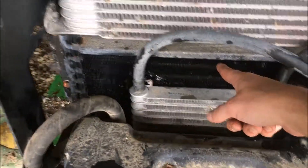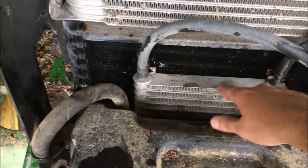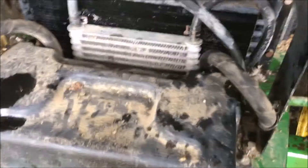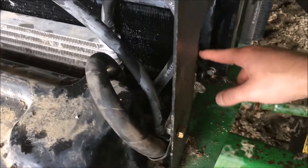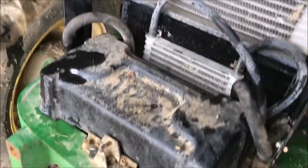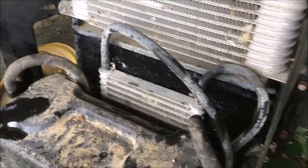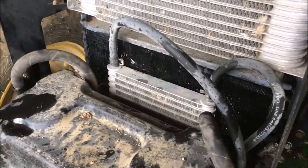I got the oil cooler back in. Like I said, it's just four bolts on the side and two on either side down here that mount the fuel cooler. I took the clamps off — it took maybe 20 minutes tops to get it out and put it back in. Before I put the hoses back on I wanted to make sure it had flow to the cooler, so I started the tractor with the hoses disconnected and it gushed out like it should. So it is getting oil to the oil cooler. If it continues to happen, I don't think the oil cooler is my problem.